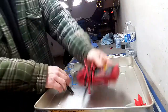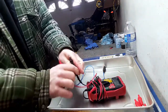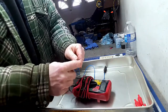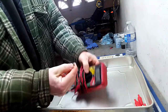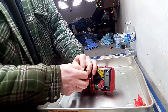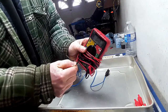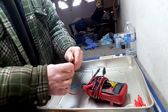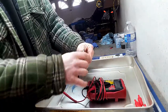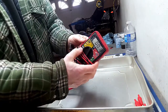And there you have it. Just to make sure, I'll show you guys I got continuity. Got my tester here, set to continuity. When the leads are apart that's one; put the leads together and it should show right around zero. That shows I have a continuous loop. I've got one lead on one end and one lead on the other end — I should have about zero, which shows continuity.